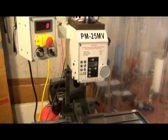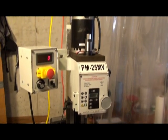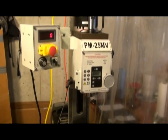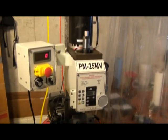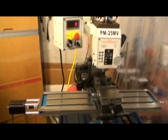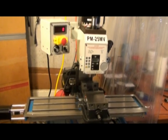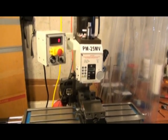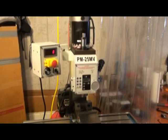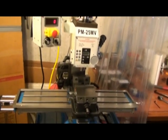That rattling you hear is actually the little guard that I've got over my X-axis DRO, so that rattle isn't in the actual axis — it's just some stuff attached to the machine. We're at about 72 inches a minute there. Here shortly I should be taking some test parts and seeing how it works for pocketing and all that. Backlash is about a thousandth and a half, which is really pretty good considering all my other axes are running three to five thousandths. Having the Z with just a thousandth is pretty nice. I re-squared the column and re-trammed the mill, so looks like maybe tomorrow I'll start doing some cutting tests.